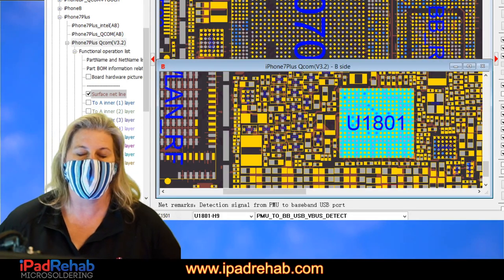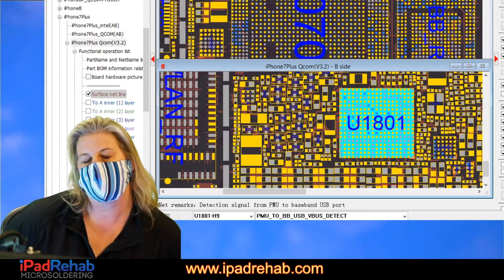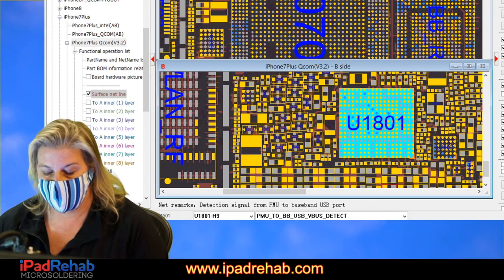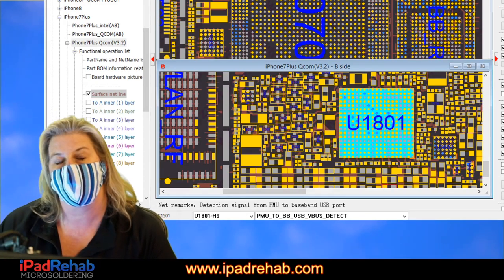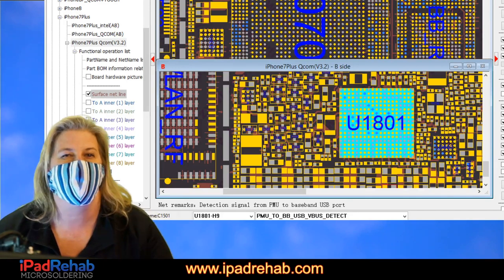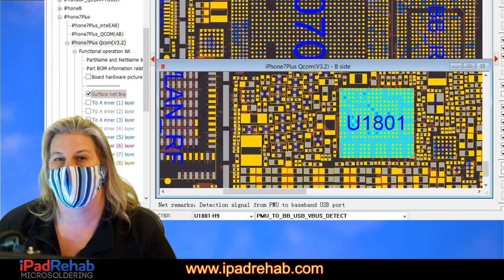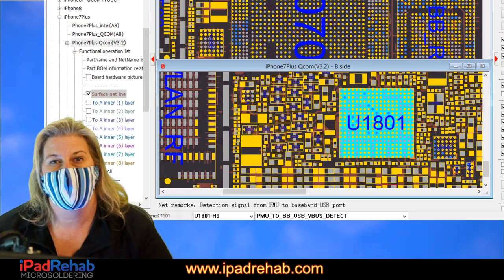What I'm going to do next is probably take a break from it so that it's fresh again. But I'm not able to use any kind of logical approach to figure out where we're losing 200 milliamps. I think that problem is big enough that it needs to be solved in order for this phone to be able to boot. We need to figure out why.